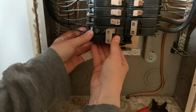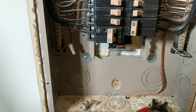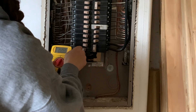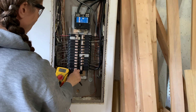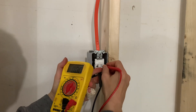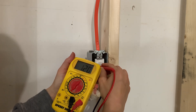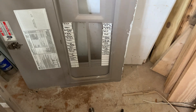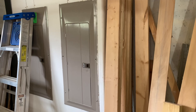I'll place the breaker into the main panel and push down securely. Once everything is in place, I'm going to test the electric to make sure that nothing is on. I'll turn the power back on at the panel and then turn the breaker on. I'll test the power on the breaker to make sure it's present, and then go back to the outlet and test the power there. What you should find is 120V at each section, and the total for this box is going to be 240V. That's a successful installation. Don't forget to label your main panel and knock out a section so that the breaker will fit, and put the cover back on.